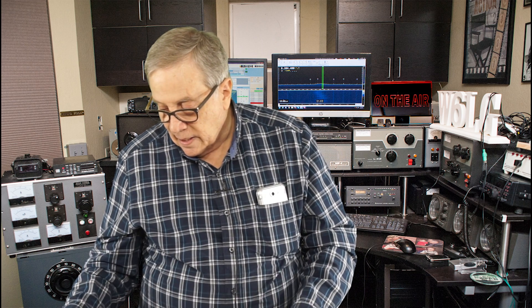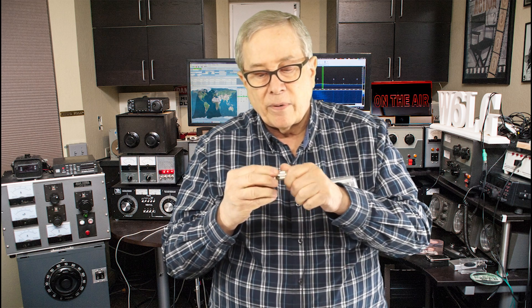It's just that easy to install a coax connector, and it's much easier than fiddling around with a PL-259 that you have to solder through these little holes and not melt the dielectric. That's how you put on a coax connector, and it's the same thing for RG58, RG8X, RG59, LMR400 — it's the same process, and that connector will work fine. It's just got to do a little bit of soldering.